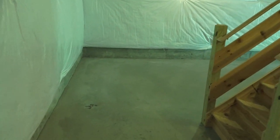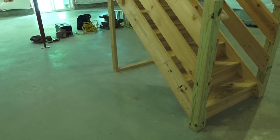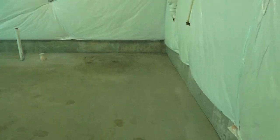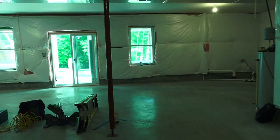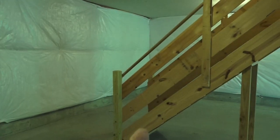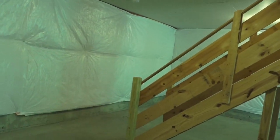The homeowners agreed that it didn't work, so we designed the bathroom to be over in the corner. You'll come down the steps and there'll be a door right at the bottom to the right where you'll go straight into the bathroom. Over here we're going to have a four-foot shower, a linen closet, and over here the toilet and a 30-inch vanity. When you come out of the bathroom, you're coming out private at the base of the steps — you almost have to turn around to get back out into the TV area.